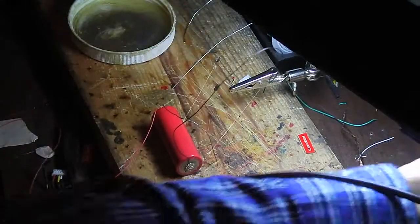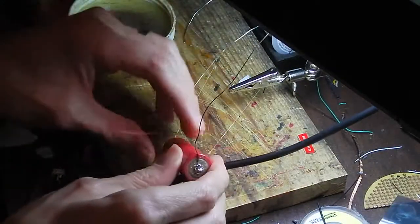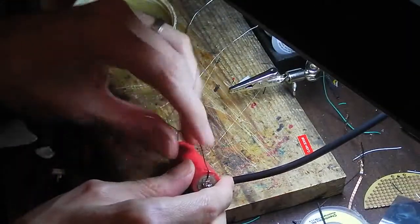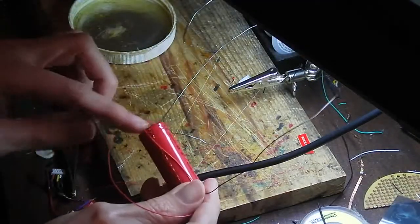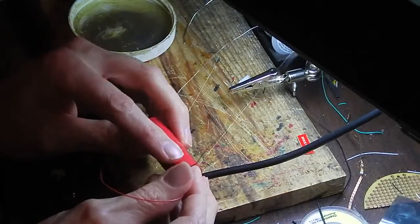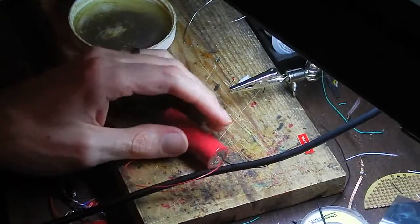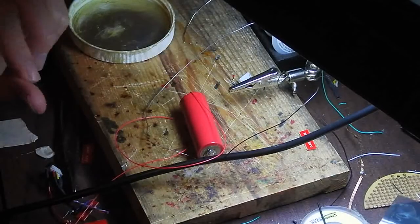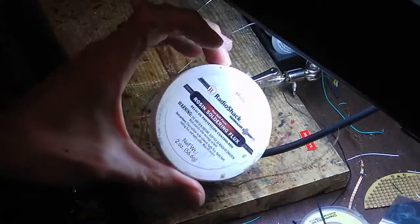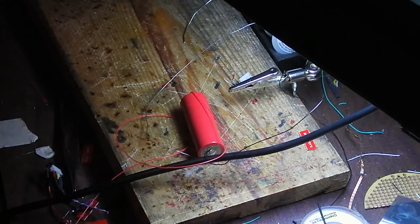You know you're done when it's completely covered in solder and it's got a good connection. Now you can pretty much just trim these wires down to the length you want, twist them up, and heat shrink or put some kind of tape on the two ends — or liquid tape, which I ran out of. But yeah, that pretty much does it. It's really not too hard. Just be careful with your iron, get the solder on, and make sure you sanded it well because the solder will not stick. I also recommend the flux — a little bit of flux really does help. I got this at Radio Shack actually. Hope that helps everyone, I'll see you in the forum.